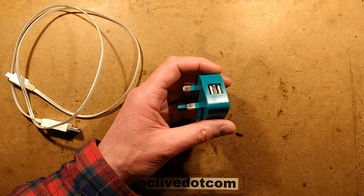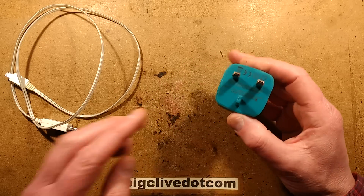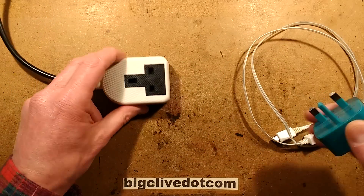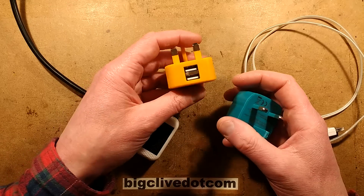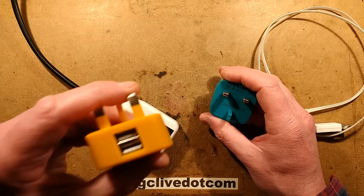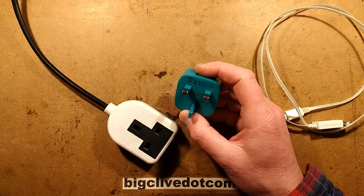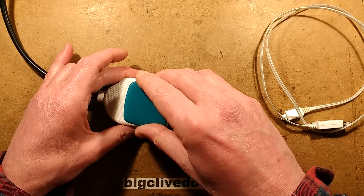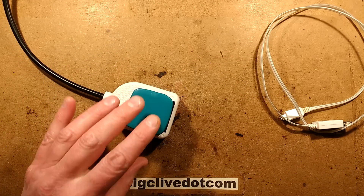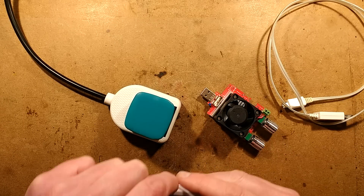Really, it will get very hot. So let's open it up and take a look. Before we do that, let's test it. It smells, by the way. If I take a new one - no smell. If I smell this one, it smells like dark circuit board - that smell of burnt circuit board. That suggests something has got very, very hot. I'll plug it in and bring down a load unit.